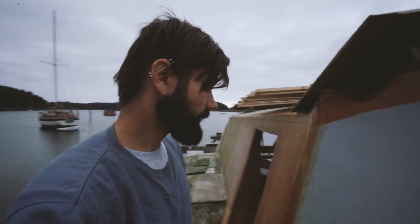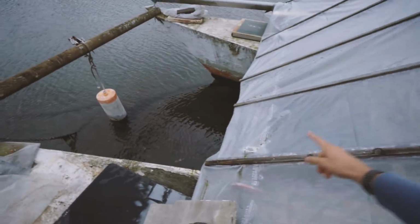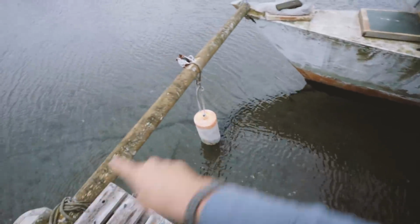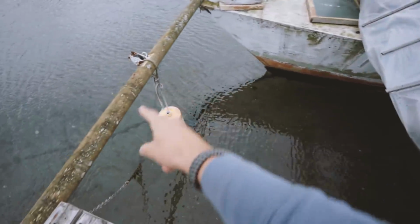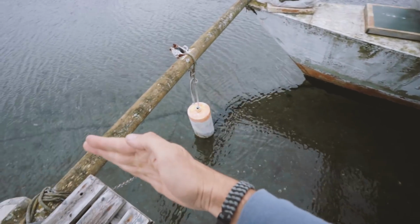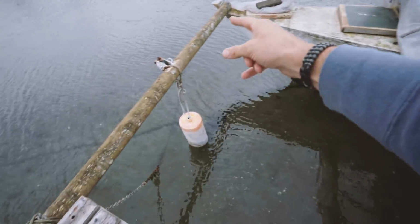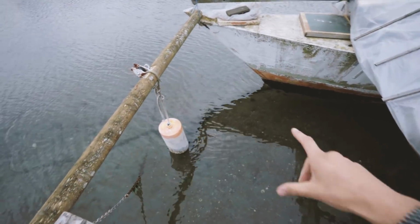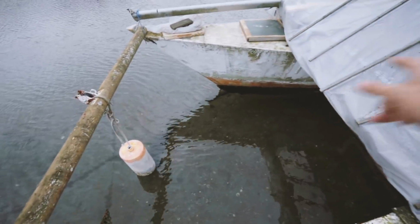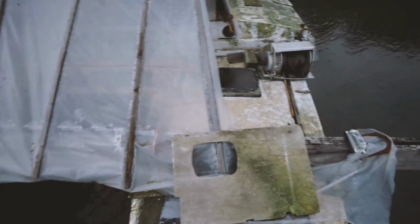Oh, all right. Sorry, I forgot to cover one more thing on the front of the deck. Up here you'll notice between the two hulls there's this big gaping hole, and so we have the main support beam, and then another beam over here, which is going to be replaced because it's original. So what I'm doing is making a basket all the way across, planks down the center, and then the whole thing lowers into the water so that I can drive a dinghy up onto the trampolines, and I can walk right up the ramp. Champ can walk right up the ramp. Just a much easier way of getting on board when we're on anchor.